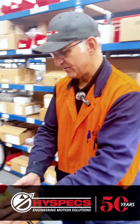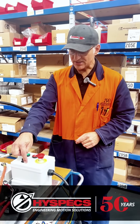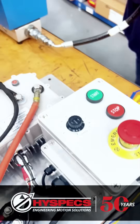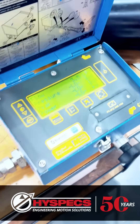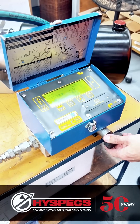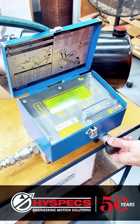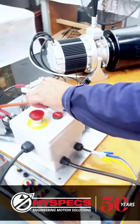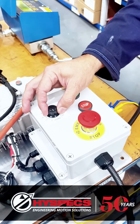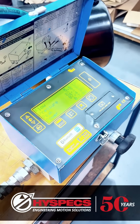Let's pretend this is on the wall. We started at minimum speed — we limited it not to zero but to a minimum speed, so this zero position corresponds to 3.4–3.5 liters per minute. We can simulate loads here. At low speed, the flow will drop below the capacity of the flow meter. Now I'll increase the flow until we get some speed — maximum flow will be around 9–10 liters per minute.